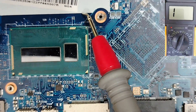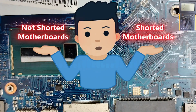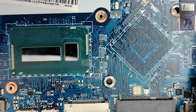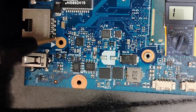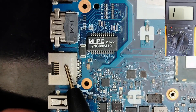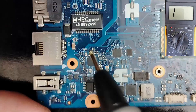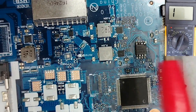I'm going to show you some non-shorted motherboards and a shorted motherboard so you understand 100%. After selecting the continuity option on the multimeter, put the black probe to ground. For beginners: we have ground everywhere on the motherboard. Put the black probe in the ground and let's begin checking the coils.